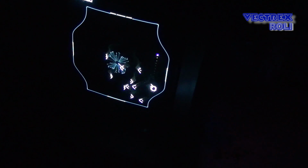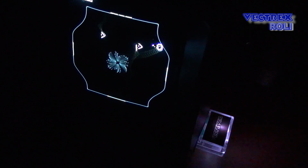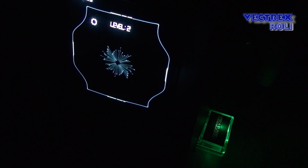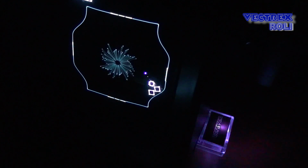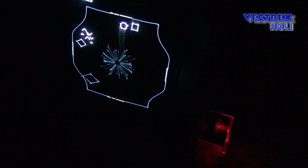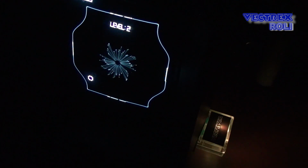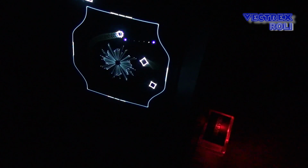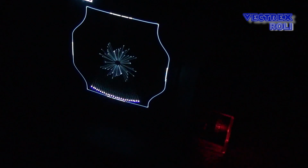The multicolor LED on my VecFever is a very nice gimmick, I really like that, and it also shows the state of the card when using it as a USB flash drive, but I can understand why it is too much effort now to include it also in the final product, and it also makes only sense if you can get your hands on clear translucent card shells. At the time I made this video, all VecFever cards so far were built with the SMD resistors for the LED already in place, and there is also still support for that in the firmware, so if you think you urgently need that LED, it looks like you can add it yourself at your own risk.